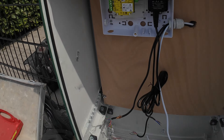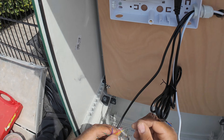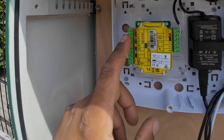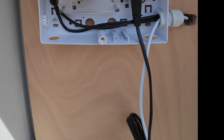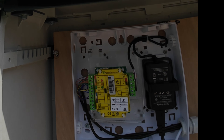When you get a Paxton P50 reader they come with an RJ45 connection on them. You cut the RJ45 connection off, strip it back, and then you're left with these colours. Because we've got two readers you can wire them in parallel - I literally just twist the colours together. It's pretty self-explanatory; your keypad emblem is there and you just follow the colours. I've wired this in now - I've followed all the colours - can't go wrong. Wired them in parallel. If you're not an electrician, parallel just means side by side; series means one after the other.